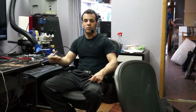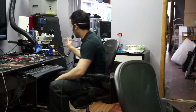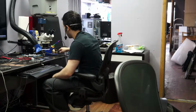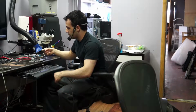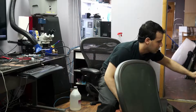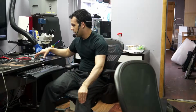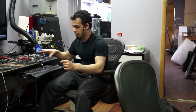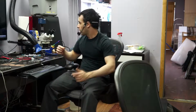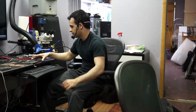With experience, you'll know how to do that without banging the board and ripping everything off of it, but rather banging it along the side of the chip so that you can get everything soldered. Again, I am not a great solderer, and it's kind of sad after damn near 6 years that I don't even know how to do it properly. You'll notice that you have a lot of problems related to that chip that are not actually chip problems or board problems, they're simply problems in soldering.